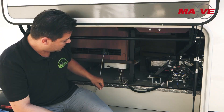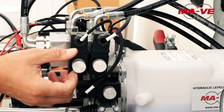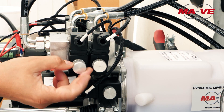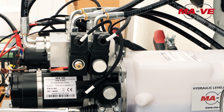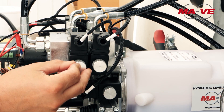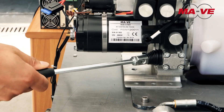From the box, the cable reaches the control panel that we will place in the camper. In the event of a vehicle electrical problem, we can remove the pistons by operating the pump manually. To do this, we have to unscrew all five plugs of the solenoid valves, remove the spacer washers and screw the plugs tight again. At this stage, we can operate the pump manually.